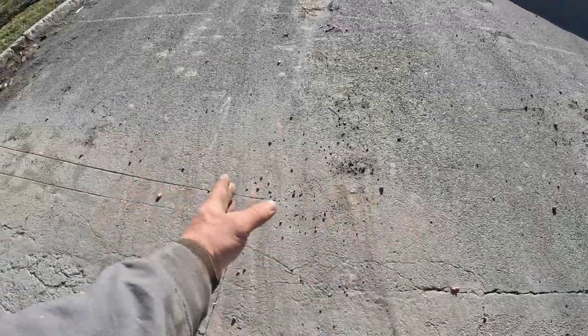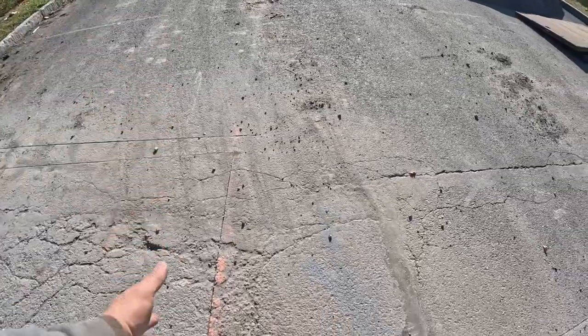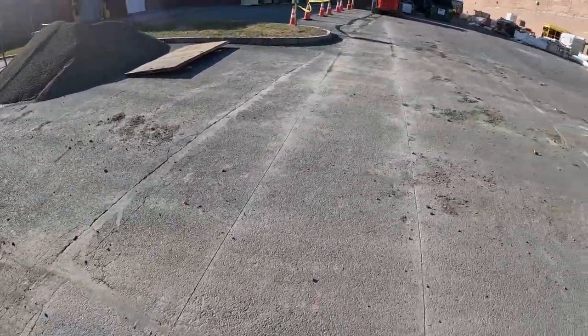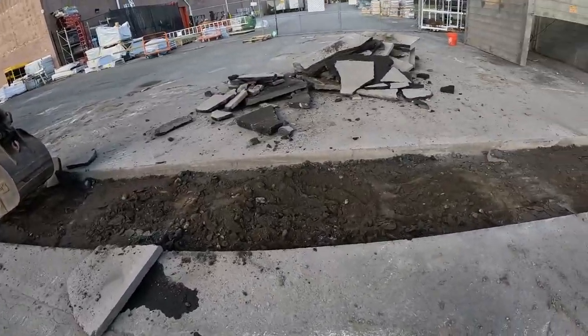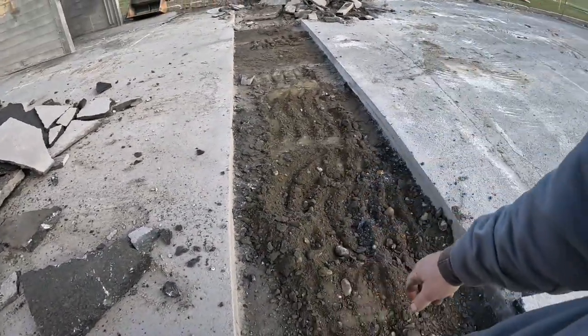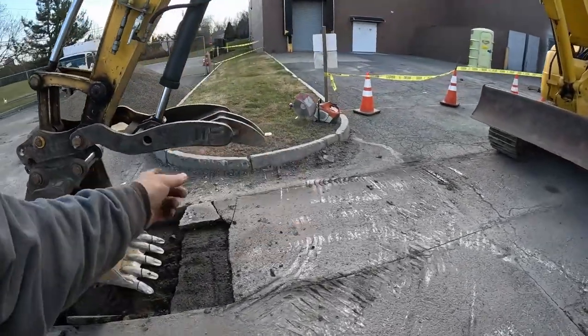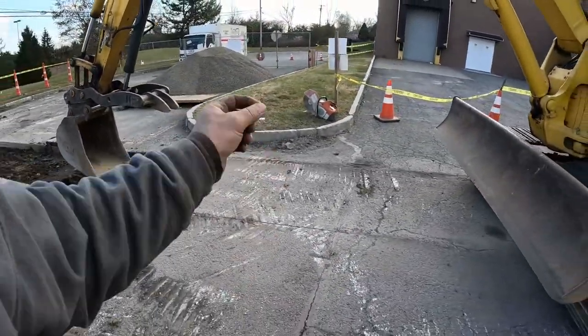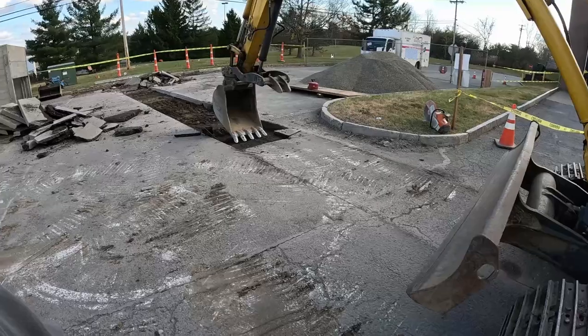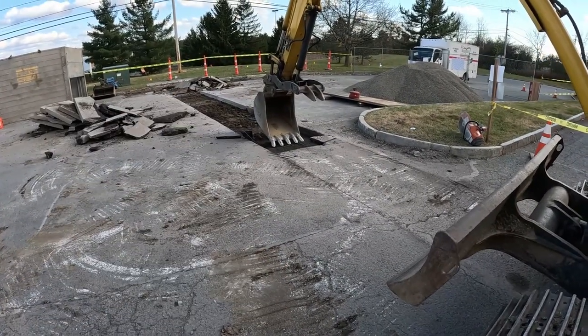But on this corner, the water line, it's right here. Now who's to say this isn't off a foot on both sides, and it's a 12-inch main, so we don't want to flirt with that and open this dirt. We just don't want to flirt with it, that's all. All right, getting the blacktop up, broke up, good 4 inches here. Had to go through with the demo saw, because my road saw, I didn't have the blade all the way down. I had it about 4. Now I get it down to the arbor, it's 5.5, and it's working out.